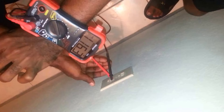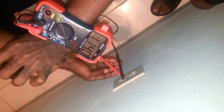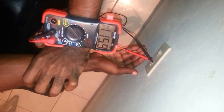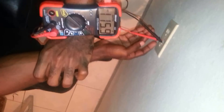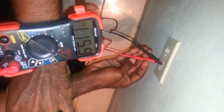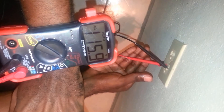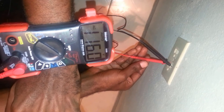The power coming to the house is actually 120 volts, so you might wonder why you're not seeing the full 120. These meters have varying levels of sensitivity — a more expensive meter will give you better accuracy. With power you'll realize you don't always get the full amount; it will vary. We're seeing 115 to 116 volts dancing around, which is quite fine — this tells you the power coming to the house is okay. Make sure the probe pins are making full contact with the terminals for a correct reading. I hope this tutorial was helpful — multimeters are quite useful and if you're into gadget repair or just like to learn, it's a handy tool to have at roughly around 20 dollars.